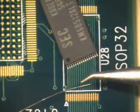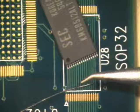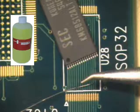This TSOP component has leads which have a pitch of 20 mil, and is considered to be a fine pitch component. To complete this procedure, the instructor will be using a lead-free solder in .01 diameter, a bent conical soldering iron tip, and no-clean flux.